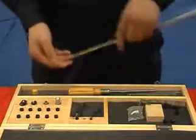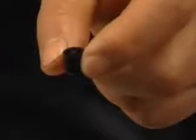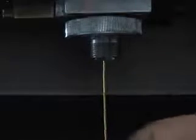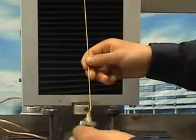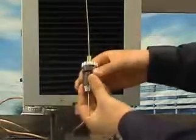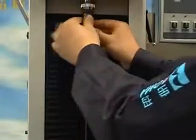Take out one piece electrode and a seal ring diameter 1 mm. Please pay attention to the direction of the seal ring. Please put the direction with mouth up and the flat direction down. Please thread the electrode through the seal ring, and then put it together into the rotate spindle.